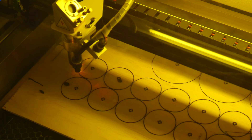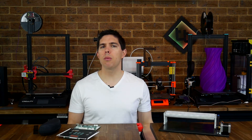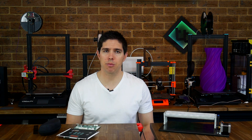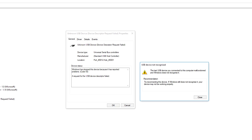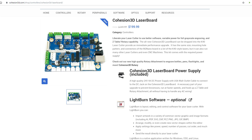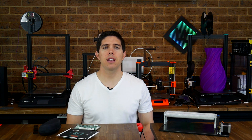Finally, I had everything in place to start some test work, except I had a major hurdle — and the footage you're seeing here is taken after I did the fix. Do you remember how I said buying one of these machines is always going to be somewhat of a gamble? In my particular unit, the laser control board refused to connect to any of my computers — I couldn't even get as far as installing a driver, so it's effectively bricked for me. But that's okay, because all along I planned to upgrade the Nano board to one from Cohesion 3D so I can run LightBurn. Like 3D printers, these are definitely machines for tinkerers and there's a lot of upgrade paths available, so you can expect to see a step-by-step guide on how I did this enormous improvement in a future video.